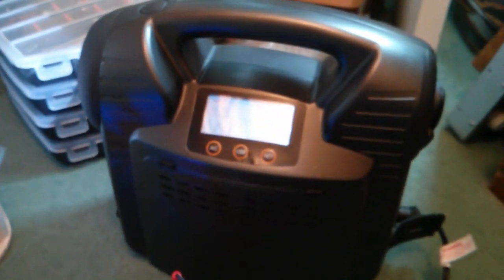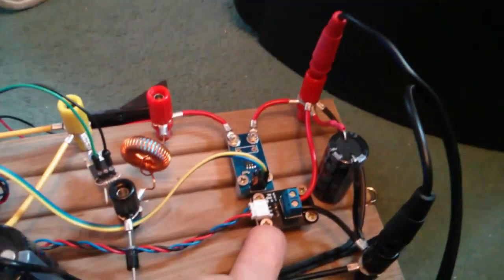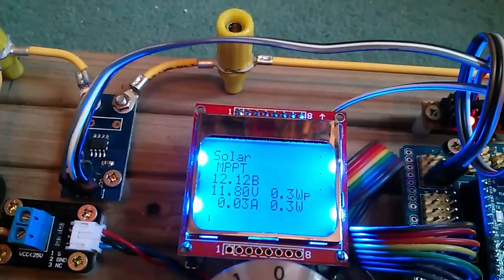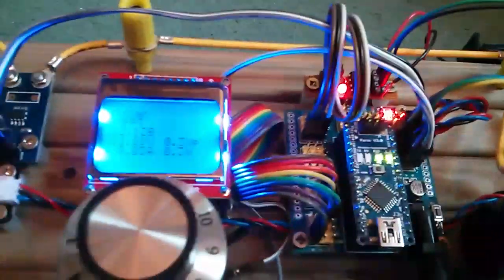I've put the battery pack from my car — the jumpstart battery pack I'm using for the MOSFET tutorial — on the battery side. There's a new voltage measurement sensor and also a current measurement sensor for the battery. Reading 12.12 volts looks about right, although the unit itself is saying 12.4 volts, so not quite sure why the discrepancy.